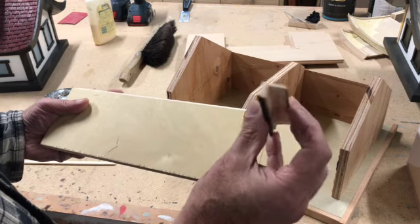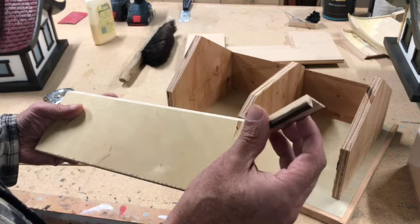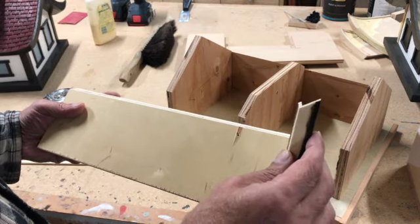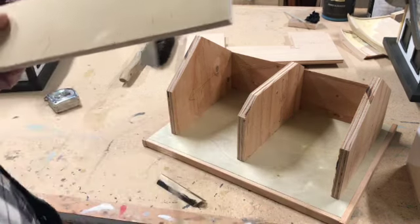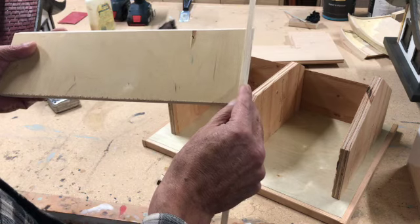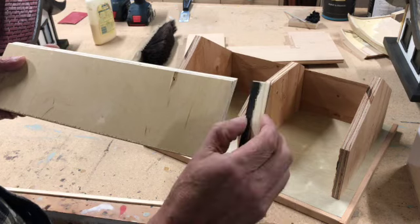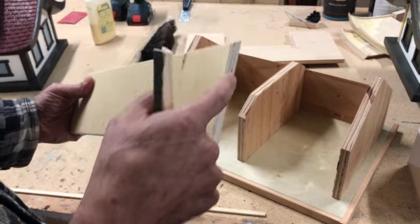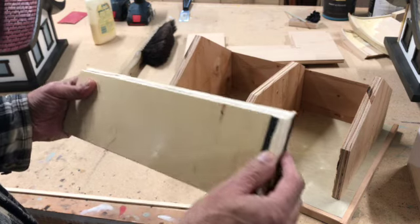Now I'm using a trim board that's shaped like this. Now this is a difficult cut to get. This is a difficult board to get. It takes 2 table saws really. And you may have to cut 2 separate pieces where you have one piece that goes over this edge and another piece that comes over this edge, and it'd be wider than this. You can see this is 3/4 inch wide going this way, and it's 3/4 inch wide going that way. And what that does, this is designed to cover the end grain of your plywood for protection.